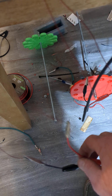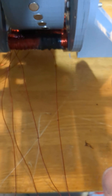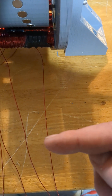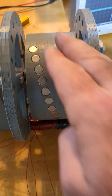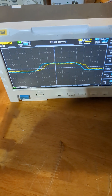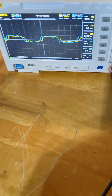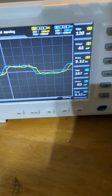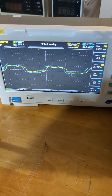I have the oscilloscope hooked up to two phases next to each other — two coils right next to each other so we can see the overlap, the spacing, the flat-lining. Let me give this a hand spin. Okay, there we go, I just paused it. That's our wave. It's not going to be a lot of voltage or current because that was just a little hand spin.